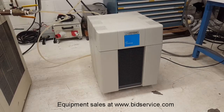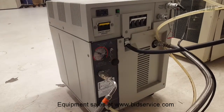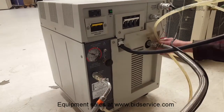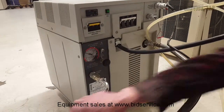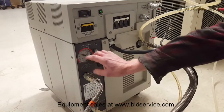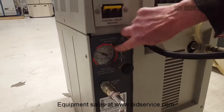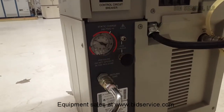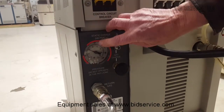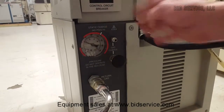Let's take a look around the back. First I'd like to show you the different connections. Here's where we have our cryogenic lines — we have our supply gas and our return gas. Here is our operating pressure gauge. As you notice, this gauge has a red bar here and a red bar here. Normal operation is within the red bars, and as you can see we're going from about 110 to 125, which is normal operation.